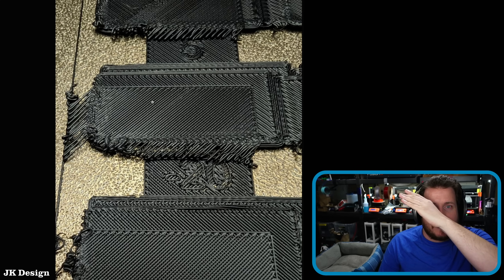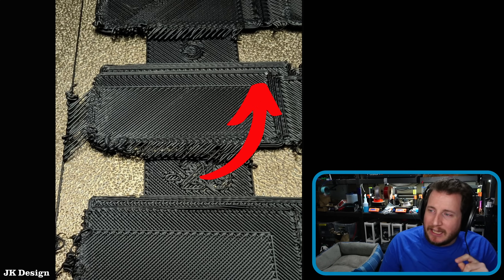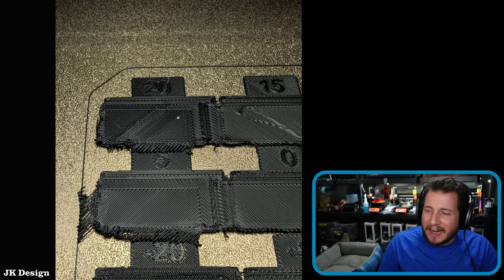Initially I said we can see that the damage is occurring in one direction, but it's not 100%. We can see that this is just occurring in the X, this is at a 45° from X and Y, and even then it's not 100% consistent. So this could be wiring, it could be an issue with a ball bearing starting to fail.